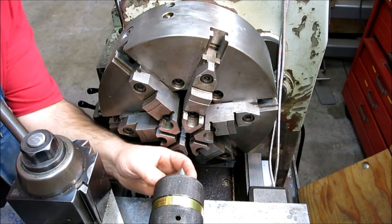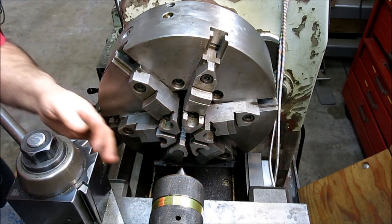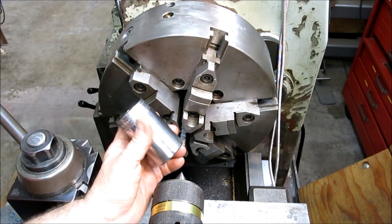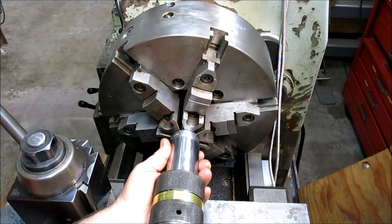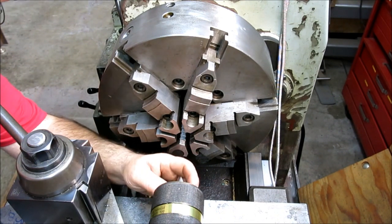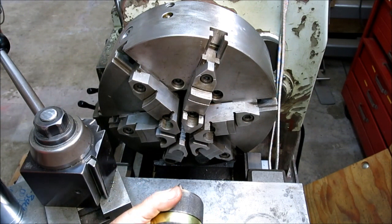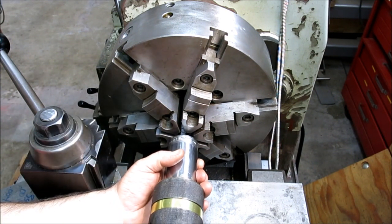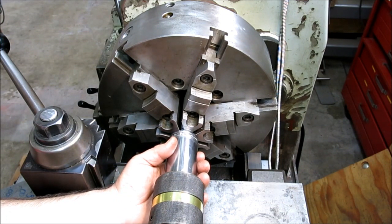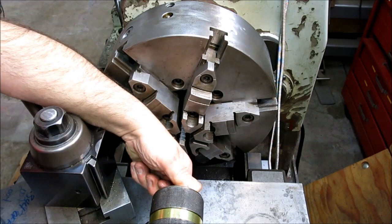I've got to go in a little bit farther because there's the seal bit. I need a piece of tubing or something like that — good old socket, right? That hardened right up — that's it. Looks about right. Let me get the seal, the little seal plate, and go from there. There's the brass seal plate. We'll use our socket tool here to push that in. There it goes — that's seated. I don't want to jam it in there too hard, and this one's kind of stiff.